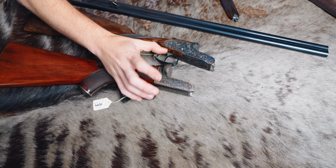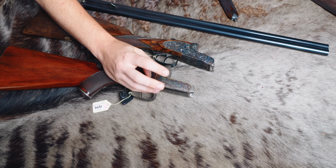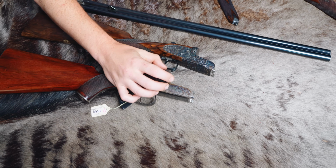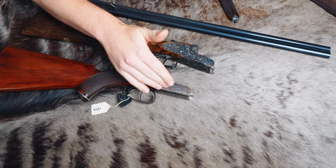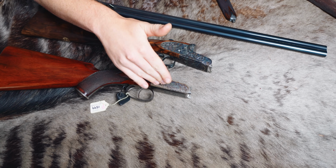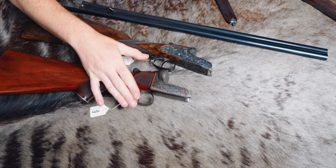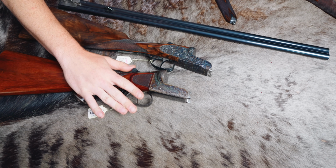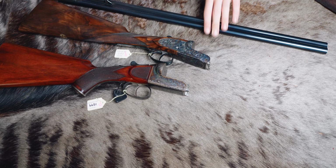And what that would do is take a very thin layer of this steel, which would take on the carbon from the high carbon charcoal, and as it was dunked into water, it would stay in the top layer, producing a very hard surface on an otherwise softer piece of metal. I think that's a mass simplification, but there you go, that's why we're here. That process obviously now is vaguely obsolete.